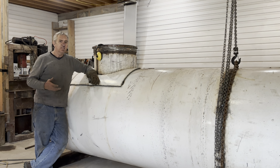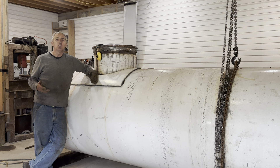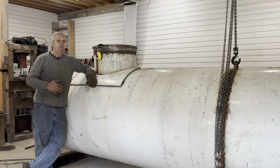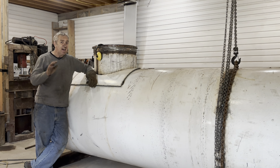The thing is, it doesn't have to be the world's most spectacular weld. In fact, you could glue those things in and they would do their job. I still like to weld them on both sides all the way around, but it's not a 100% full penetration weld — it's just a fillet weld on each side. So that's done.